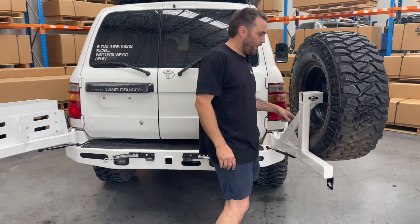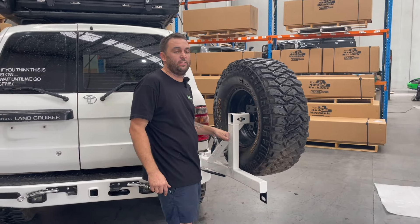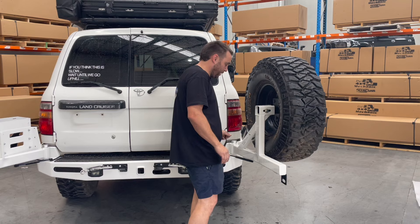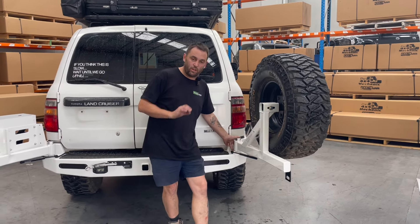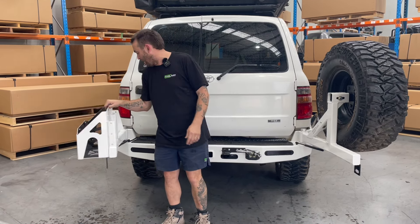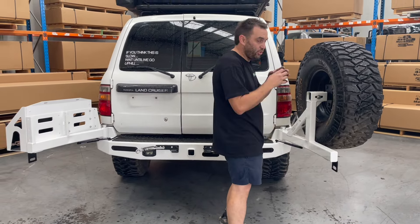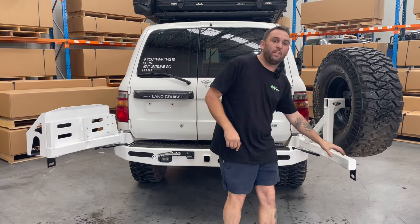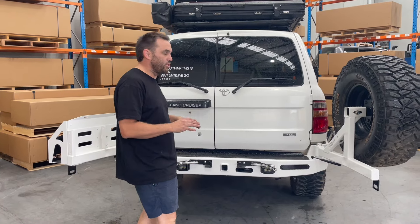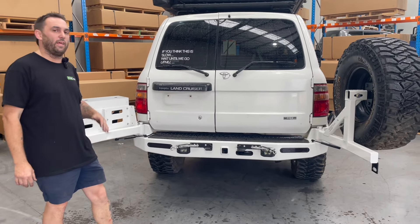Integrated light pole mount, adjustable wheel plate. These are a fixed carrier — that's how we've always done them and I'm not changing. I know they stand the test of time — I've literally got thousands of this construction out there. Four mil RHS, it works. Large bearing stub, integrated stopper that's hidden, so the contact point is really neat and concealed. If the stopper were on the outside, when they're white and they get the whack point from opening all day, they look rough within a week. The contact point is hidden inside and they're super strong — actually machined into the hub, not welded on. My kids literally bounce these off the stopper, so I wanted them super strong. That's pretty much all the features and changes. Super happy with it — a couple of little tweaks to do and these will be into production later in the year. Hopefully running them just before Christmas so you can get them in January.